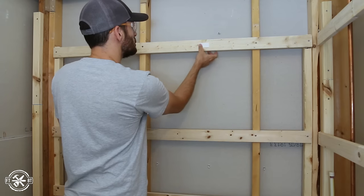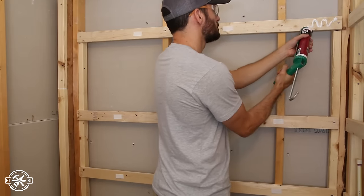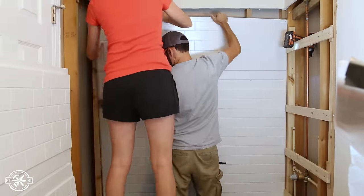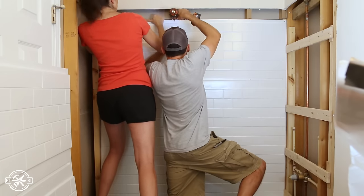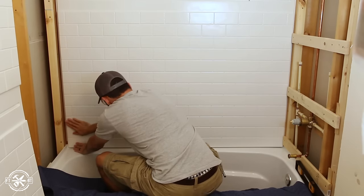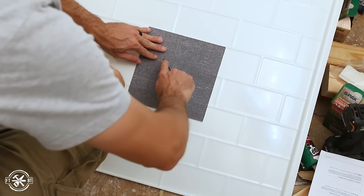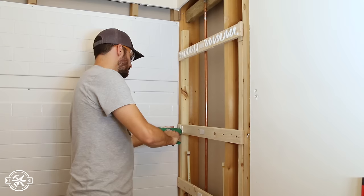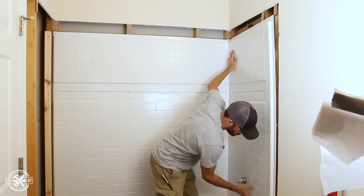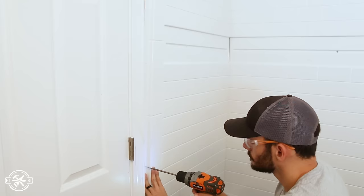The wall kit comes with double-stick tape to help hold the wall to the furring strips while the adhesive sealant sets. I used DAP 3.0 for the sealant, which is one of the three recommended products specifically for this acrylic material. A generous amount of adhesive is put onto each furring strip, and then we brought the back wall in. We held it in place, making sure it was level to the marks made during the dry fit, then I secured it to the studs along the top flange and in the screw recess in the accent tile channel. I pressed the rest of the wall firmly to the double-sided tape for good contact. Before installing the wall with the plumbing pipes, I put on the fire retardant pad provided in the kit and cut out for the mixing valve. I applied sealant to the furring strips and wedged the wall piece in, secured it with screws, and repeated the process for the left side. The biggest thing to watch out for is making sure the side walls are tight to the back before you secure them, so there aren't any gaps in the corners.